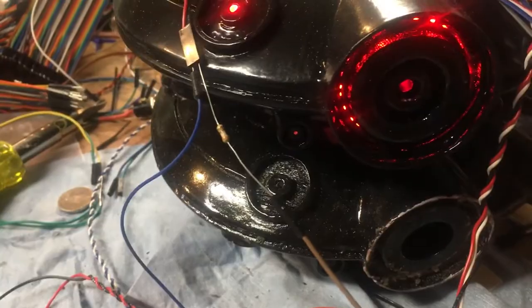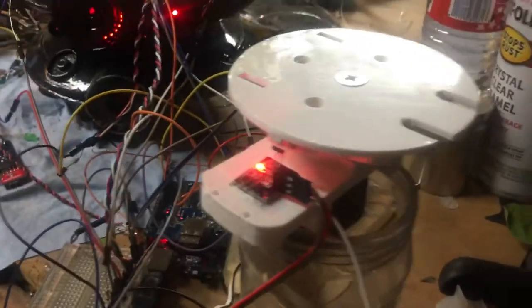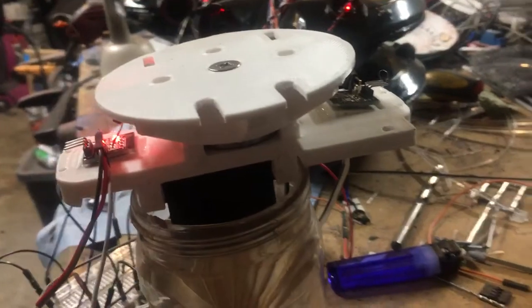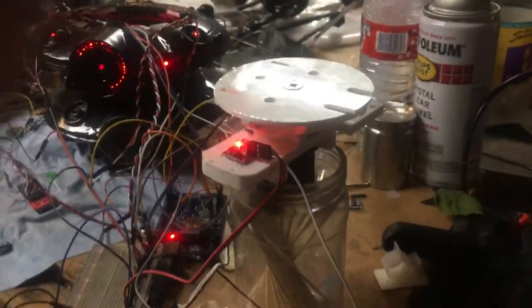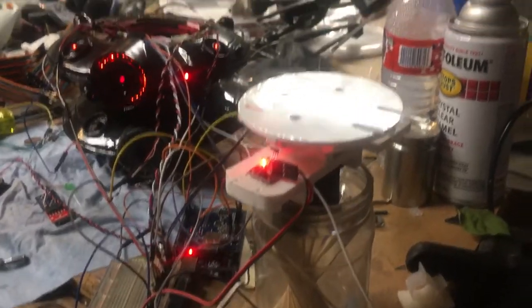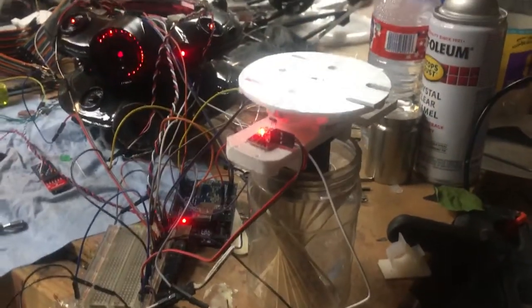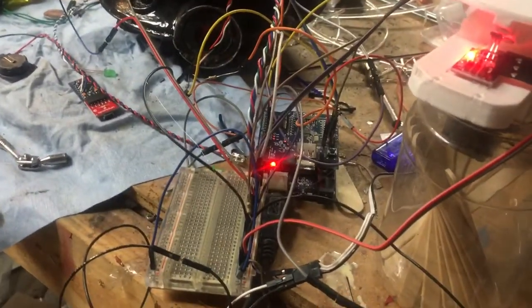The center is just a solid red as well. The servo body — our main body — has a spin plate and a couple of hall effect sensors. These pick up on magnets in the base so that I can determine home and rear position and drive the droid to those positions at will.